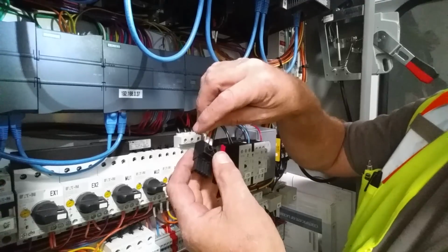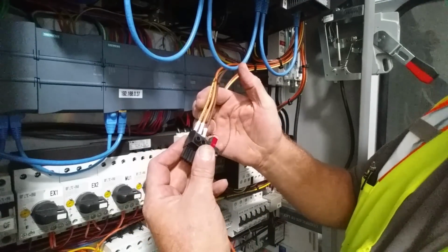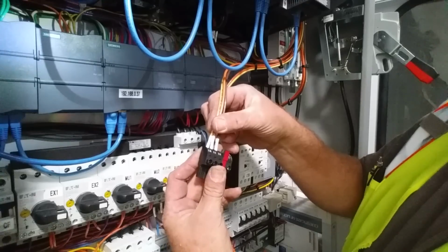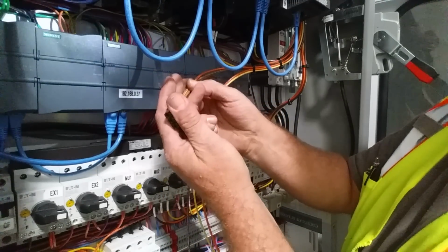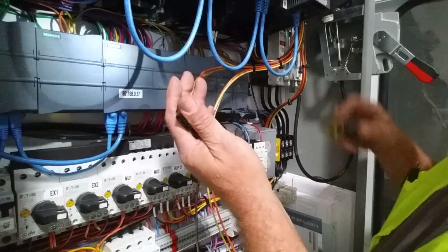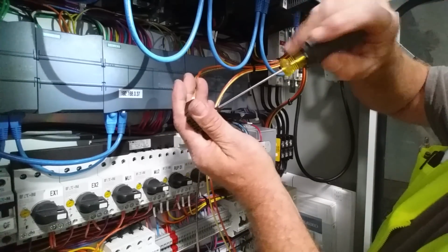BOY. Always remember BOY: brown, orange, yellow. So BOY right there on your terminal block. Drop them in. They're already at the right distance for wire insertion. So that means when they get shipped, the screws are already backed out. You just drop your wires in and go.